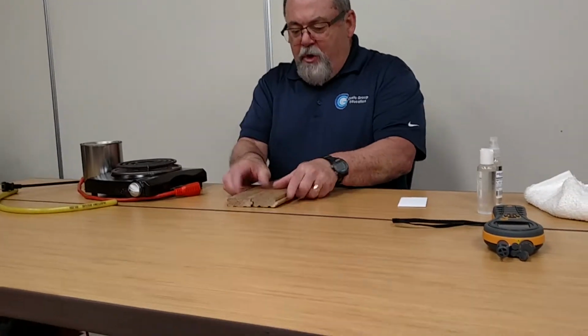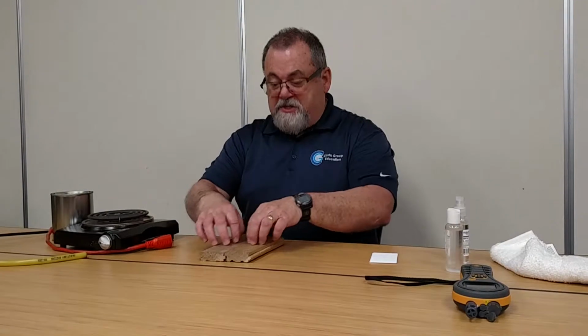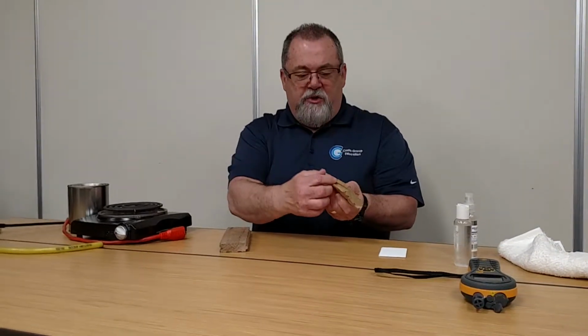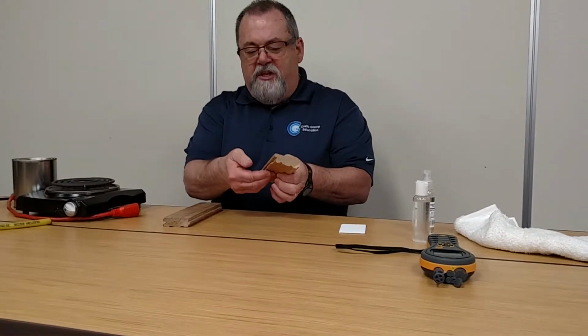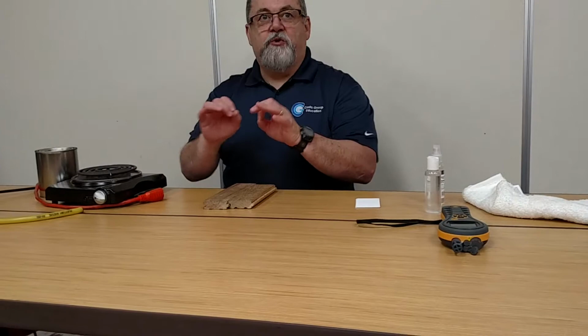So, when you've got a wood floor that gets wet, and the water's been applied on top, and it's sealed, the water doesn't go through the sealer. It'll enter the tongue and groove, it'll enter the side of the wood where it's not sealed. When it hits the floor, it moves in the letter T, and it absorbs from the bottom. So the sides and the bottom of a wood floor are always wetter than the top and the core. So every wood floor is always under a level of stress when there's water damage.